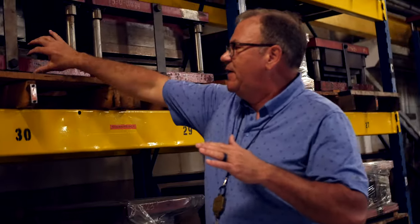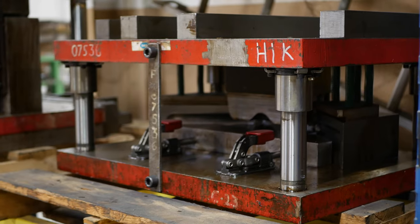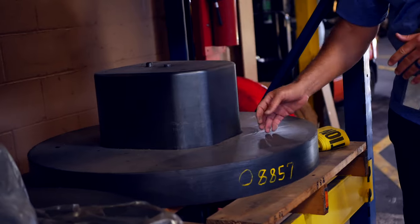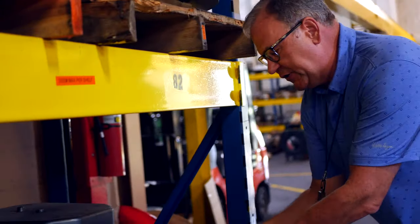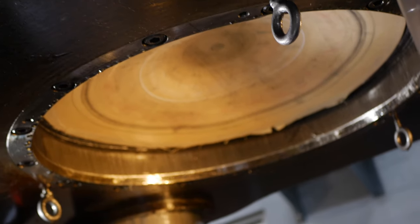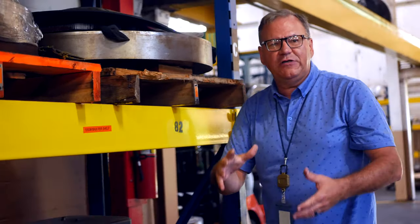I want to show you the difference between stamping and hydroforming as far as tooling costs. In stamping, you have plates, posts, springs — a lot of activity and a lot of cost building die sets. With hydroforming, we just have a ring and a punch. Here's a good example of a hydroform tool: the punch is the shape of the part — this will be the ID of the part — and then you have a ring that the punch fits inside of. When it's in the press, the punch is lowered to the level of the ring, the material is put on there, and then the punch drives up while the bladder pushes down on the part.